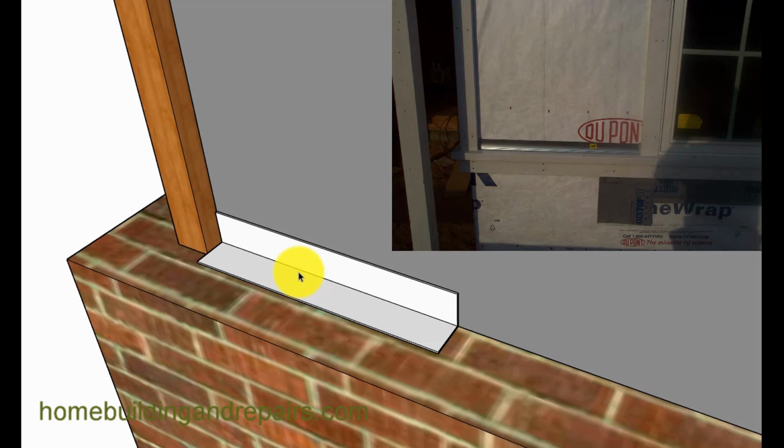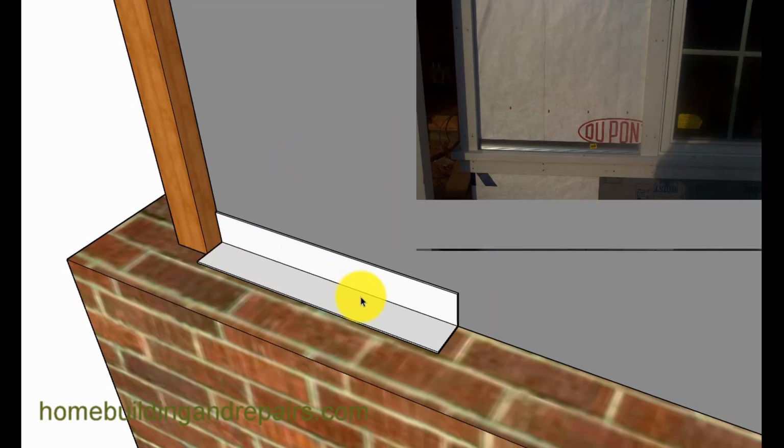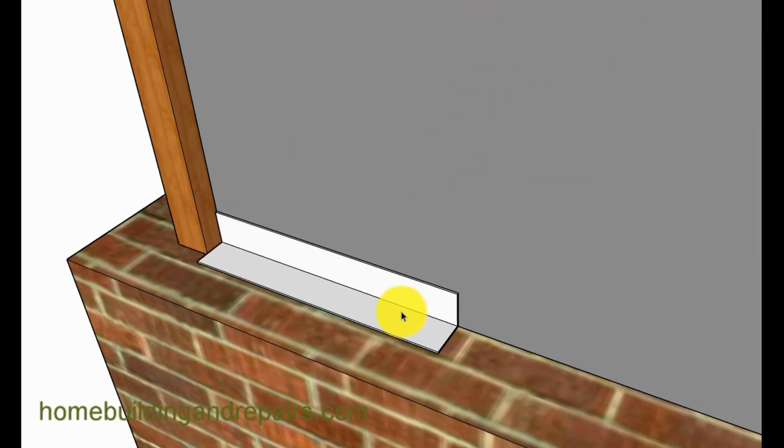And this right here might give you some ideas for finishing the metal with the building exterior, but this individual had a problem with the siding, and I guess it rotted out an area at the bottom of it, and he kind of wanted to finish it. So what you're going to need to do is put some metal, and this can simply be L metal. You can run the metal all the way over the brick cap, and most of the time the brick, I should say, hopefully, is going to be shaped to where it's sloping downward.